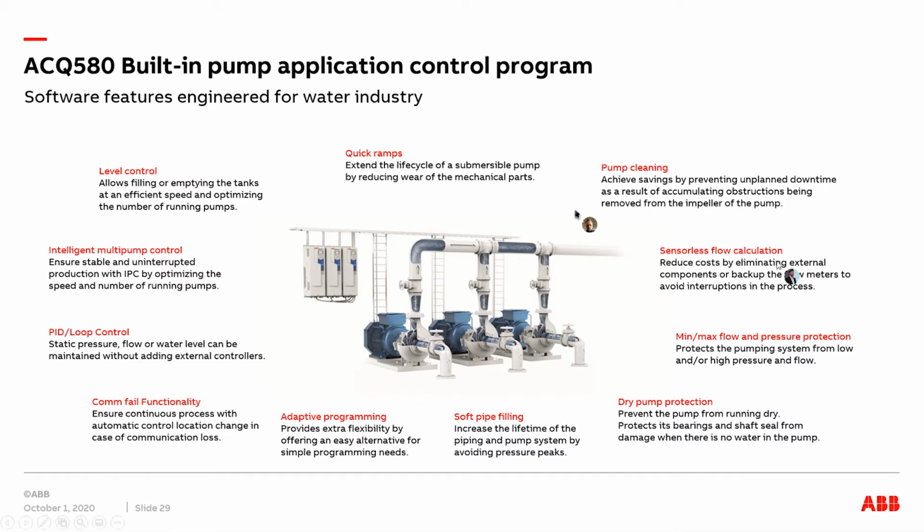I think one of the special ones for me is the sensorless flow calculation. I didn't mention it on a case study, and often people will come to me and say that ABB is the market leader in flow products, flow meters on a global basis. And what I try and highlight is, although the flow calculation built into the drive is a calculation, it's not there to replace the flow meter. The tolerances in it mean that you couldn't use it for any kind of metering purposes, but you can use it for early indications.